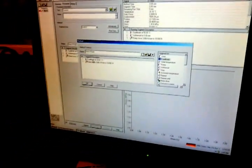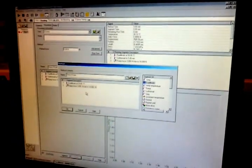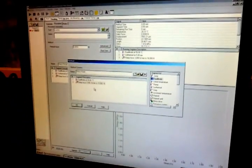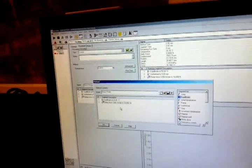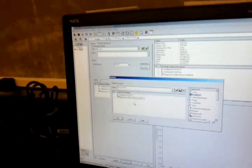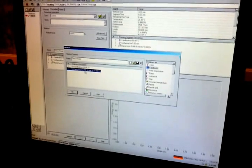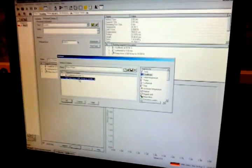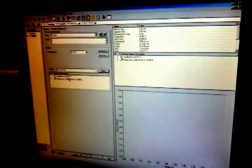For example, you can set equilibration at 82°C and then start pulling. You can change the pulling rate — right now it's 3 newtons per minute up to 80 newtons. The machine limit is 80 newtons, so if your film is stronger than that, the clamps will reach the maximum limit and get stuck. Sometimes if your film is pretty strong you can break the films at that limit. So you can change the ramp force — I used 1 newton per minute, while the default is 3 newtons per minute.